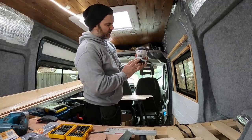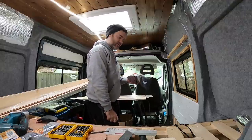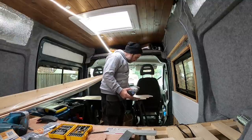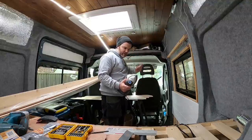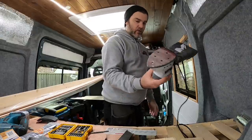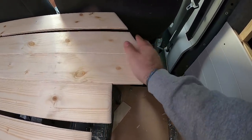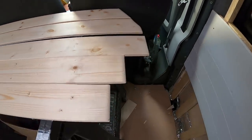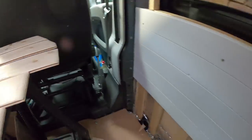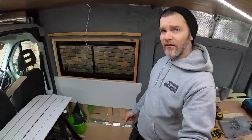This is quite a cheap sander from B&Q - I had it for years. I bought it when I was doing my other conversion and didn't really use it on that build. But it's great for curving the ends of the cladding, just to take off that sharp edge and make it look curved and sweet - I think it looks really good. It's from the Mac Allister range at B&Q - I'd get one, pretty good. I've just been sanding the edges so they're nice and smooth. Chamfering the end makes all the difference when you butt up the carpet - just curves it in a bit. Then the second coat on the bottom half of this, and it's going to look really smart.